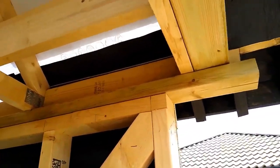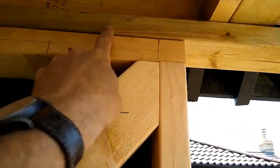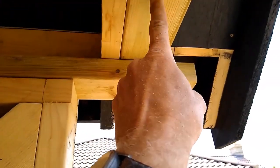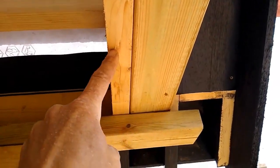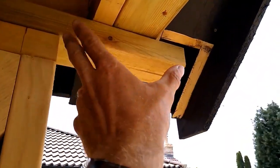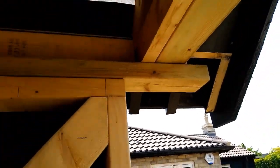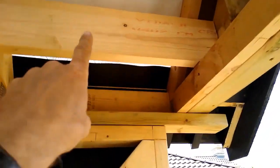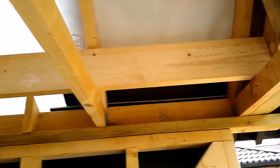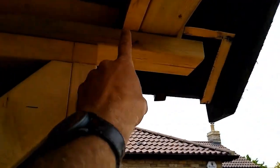When I started making this carport, the oak had been delivered so I could get on. I put this on my second wall plate and ran it through to support this gable wall and this last truss. The oak goalpost we've made has got to come and support this, so I need to cut this out. To temporarily prop it, I've put a piece of rafter material all the way through, which should support it so it won't drop when I cut it out, and when we put the oak in it will catch it all up and tie it in.